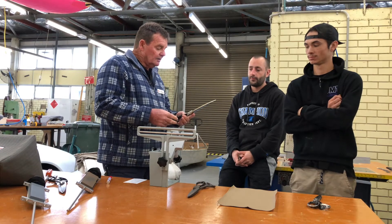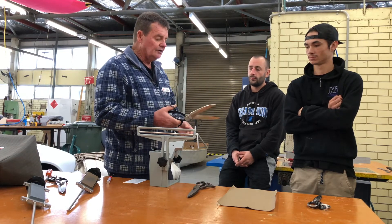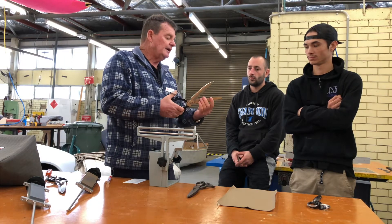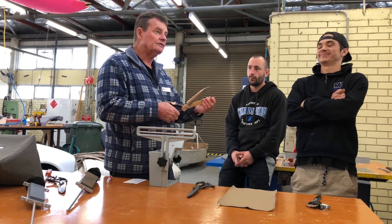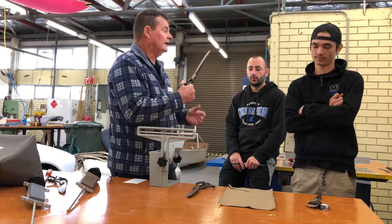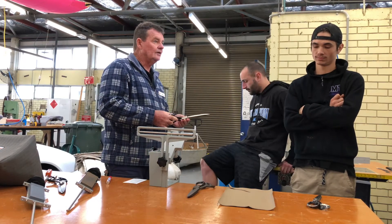The biggest problem many people have with shears is that when you open a pair of blades and cut up and down, it's metal on metal — that wears out the cutting edge. Whenever you open a pair of shears, you should always cut material and leave them closed. Opening and closing without cutting wears them out.